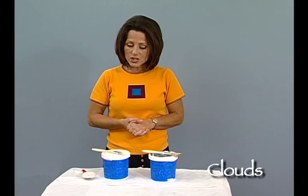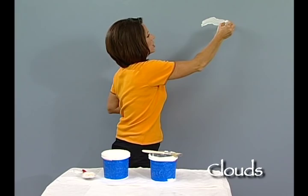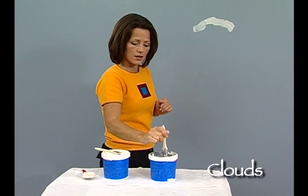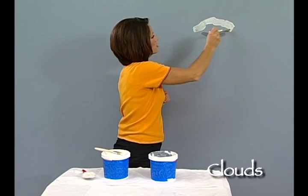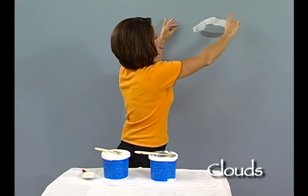The first thing we're going to do is take our small brush, dip it into our white glaze, and start at the top portion of the wall creating a jagged scallop. Then take the other chip brush, dip it into the gray glaze and apply another scallop. The best formation is almost shaped like an eye — thicker in the middle and pointing out towards the edges.